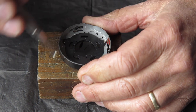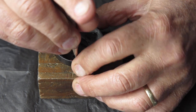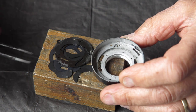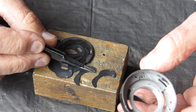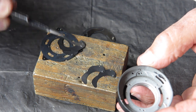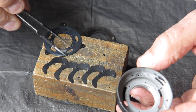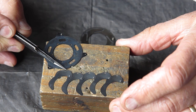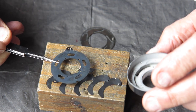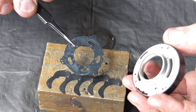There are three screws holding the retainer in place - the screws are not loose, that's good. Let's tip out this diaphragm. I'll have a quick look at these blades to see what state they're in, to make sure they have both of their pivots and that they're not too distorted. There's a little bit of distortion on these blades - it's pulled down at this point on the rivet. The retainer plate here is fairly clean, but it certainly needs to be cleaned better - you can see that hazy finish. That's a deposit left over after solvents have been applied.